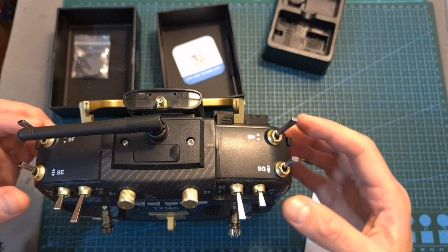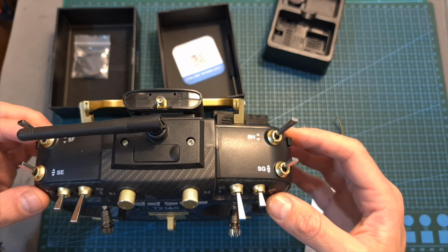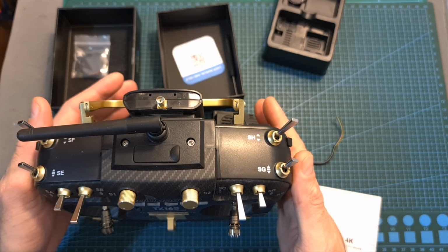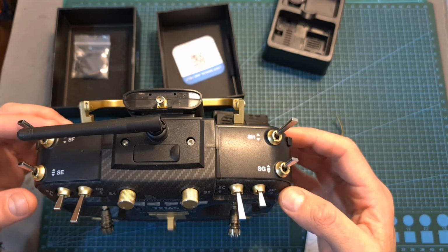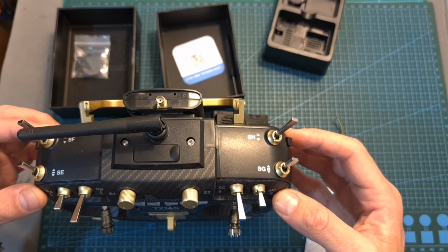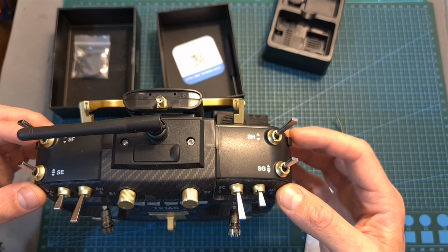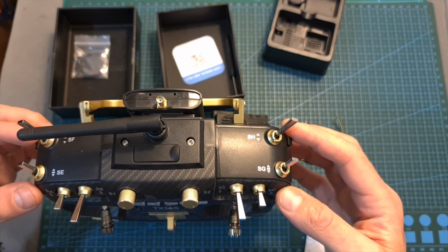The assigned auxiliary switch on your radio controller is going to simulate the camera recording button, which will enable you to start and stop the recording procedure using your radio controller remotely, which is especially convenient because in case the camera is going to lose power, the recorded video is not going to be saved, and preferably you should assign it to a momentary switch as it is more convenient.